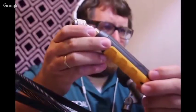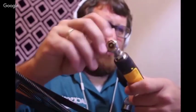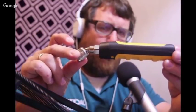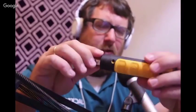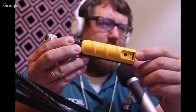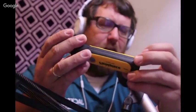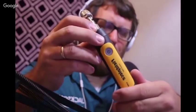Let's take a look at the pressure sensors. You can see the pressure probe right here — little button on the front, same way. It has our Schrader there. Maybe a little bit longer than some of the competing probes like the Testo, but not much, not so much that it'll be hard to handle. Hit the button to turn it on, hit the button to turn it off. There's a little selector dial on the back side — you go from liquid to suction line, so depending on how you're going to set this thing up, you just switch it over and it changes its designation.